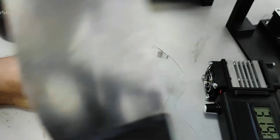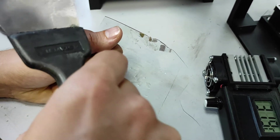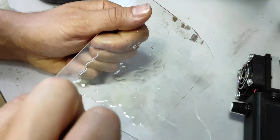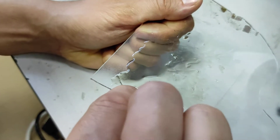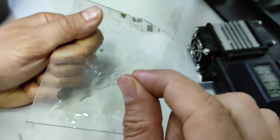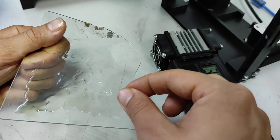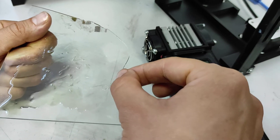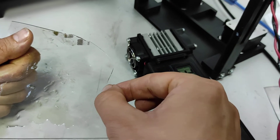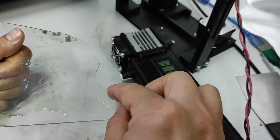We have this piece — it's actually very, very thin. You see it's very thin — it's like pulling out an alien! You can see they're very thin, cured material. So that actually reacted with the real UV laser beam. We plan to use this Galvo for printing because the result is very, very thin. The laser beam quality is TEM00 and the wavelength is 355 nanometers, so we can get a really, really tiny spot.